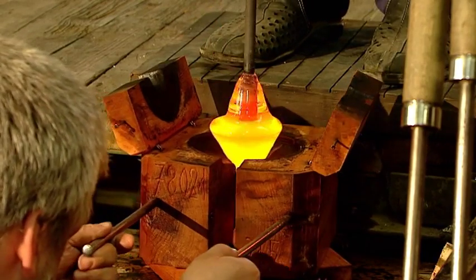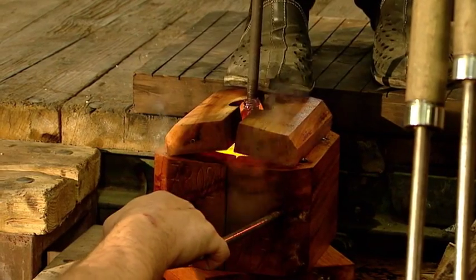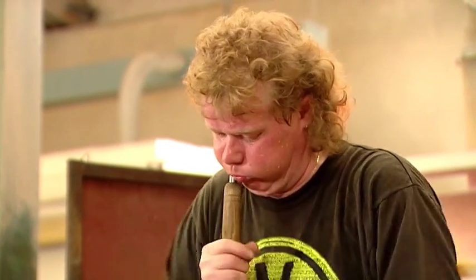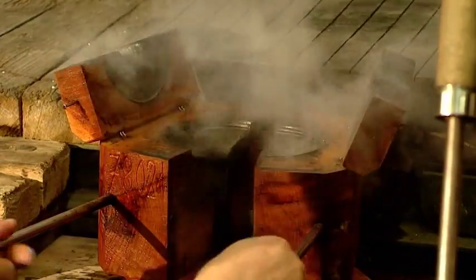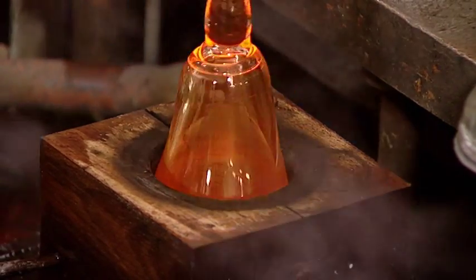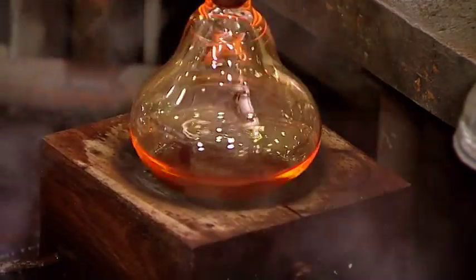Glass is traditionally formed through blowing a glass blob into a two-piece wooden mold. It is an ancient method that was being used as early as the 5th century BC. The mold gives the glass its form. Most products which have a more complicated shape cannot be made in any other way than by blowing into a mold.